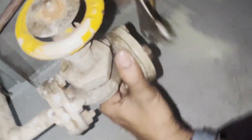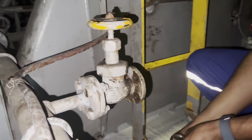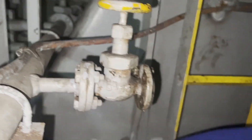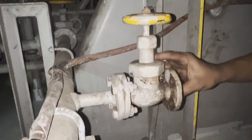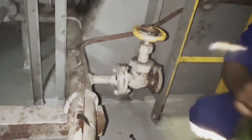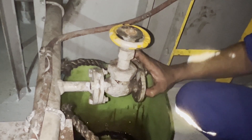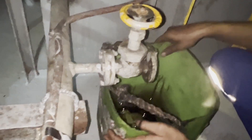This is the valve, and our third engineer is opening the valve blank. Once the end flange is opened, as we follow the regular procedure, you have to drain the oil a little before taking samples. You can use a bucket or a tray for draining the oil.